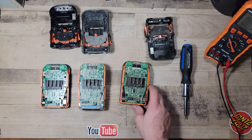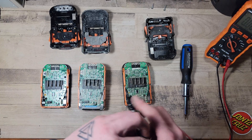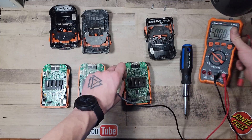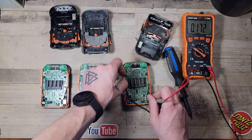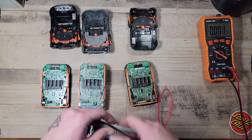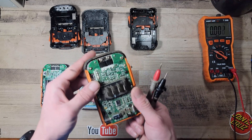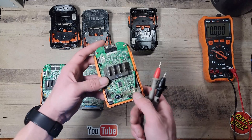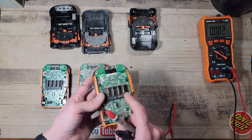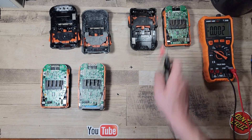To check the pack voltage, you'll see two big solder blobs — those are your two main lines. It doesn't matter which probe you put on them; it'll show either a negative or positive reading. As you can see, it's 0.18 volts for the whole pack, which is horrible. That pack is apparently dead — the cells are completely dead and we're not going to save them. The only thing good in this battery is the board, assuming the board isn't what killed the cells.